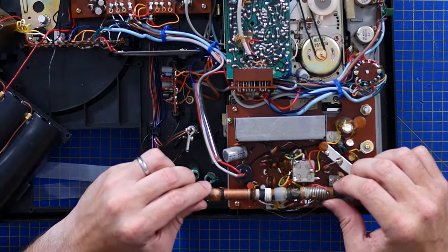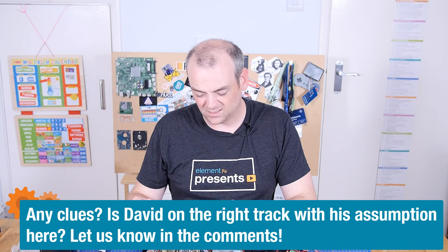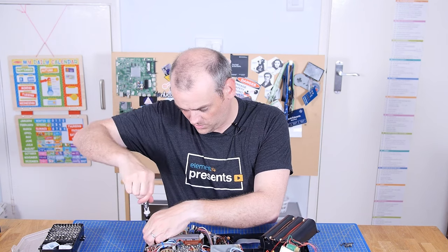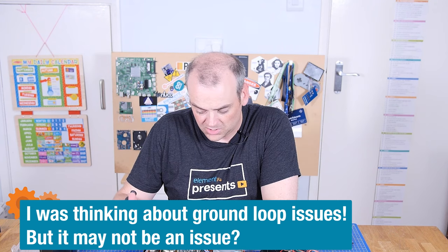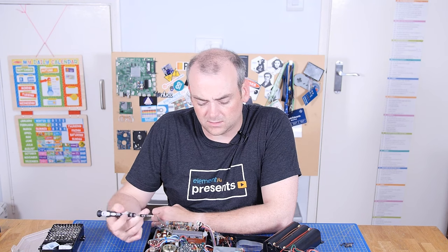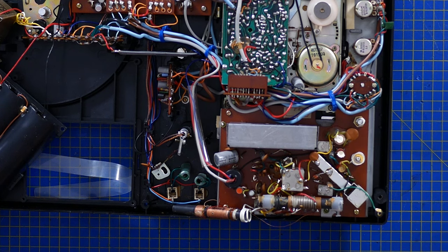I'm so upset about this ferrite core. Has anybody got any good advice on how I might be able to repair that? I suppose it only needs to be magnetically coupled, it doesn't need to be electrically conductive — so maybe I could just glue it and it would be good enough? Let me know in the comments. There's also a grounding screw in the corner here. Designing something like this where the parts are all kind of together but kind of separate — they've got electrical interfaces which should mean they're galvanically isolated at the output side. Maybe this switch is not just switching the audio outputs, it's also switching the power to the various functions. That'd be a great way of extending battery life.